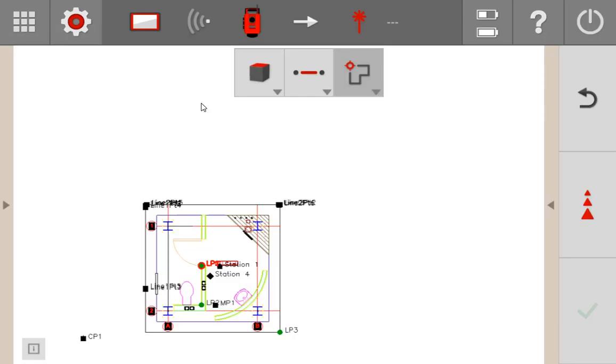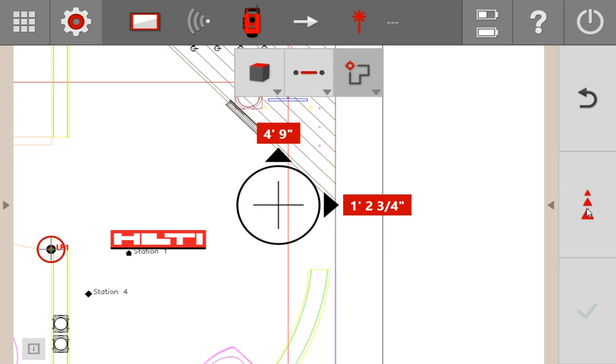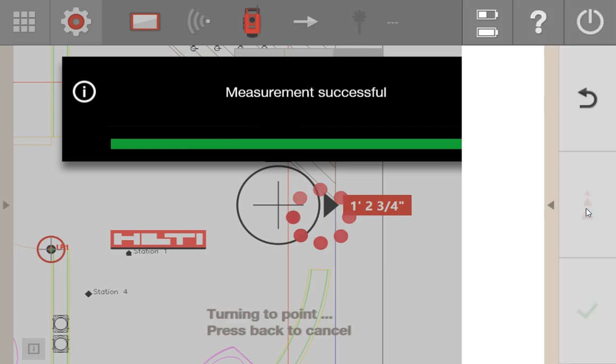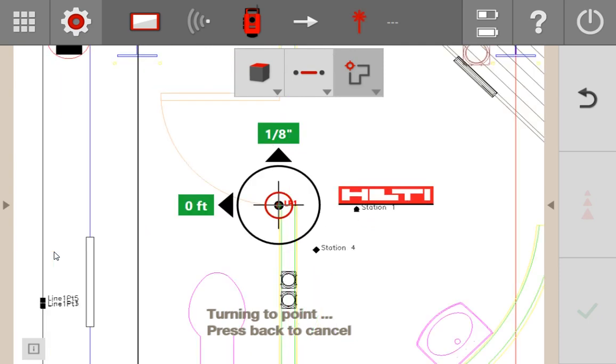The warning phrase telling you to turn to a benchmark is only going to appear for maybe two seconds, and then a new screen pops up showing it's trying to find that point. Don't worry — just press the measure button and measure the surface you're trying to lay out on. I'm measuring my ceiling right now because that's where I want to lay out these points. After I measure, the tool is thinking and automatically turning to where that point should be, giving me a layout with the laser.